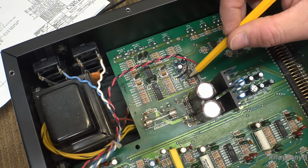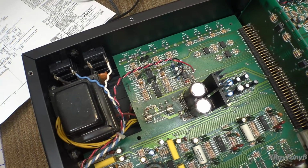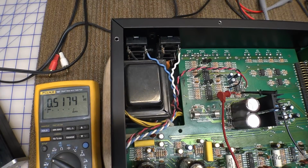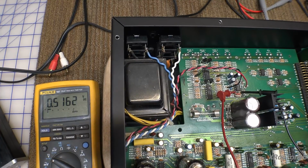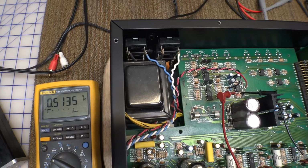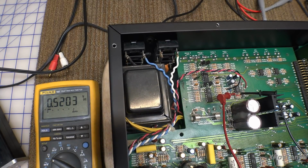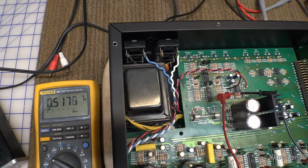But let's get a meter on here and see if we can see what kind of voltage we have. All right, we're clamped on here. Let's turn it on. We're just looking right across that Zener diode. We should see 10 volts there, right? And I'm not seeing any volts. Am I? Oh. Take two. It helps to plug it in. The electrons have a hard time jumping from the outlet to the prongs of the plug. So let us plug it in and try once again.